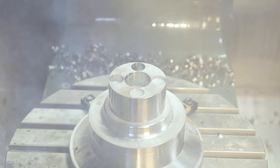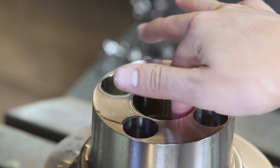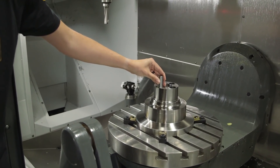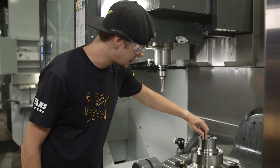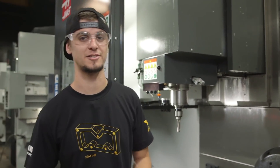I just got done drilling this piece of titanium. I know that whenever we're drilling harder metals they tend to run a little small, so I have my .982 pin and this is what I'm going to use to check it and make sure it's perfect. My pin goes in — not too tight, perfect all the way down. That's the sound you want to hear. I know that bore is exactly .982.